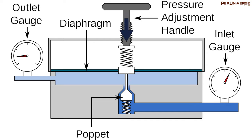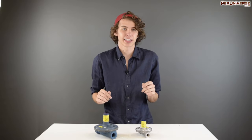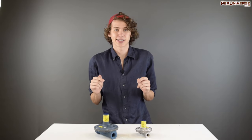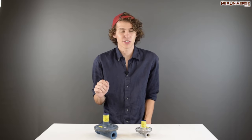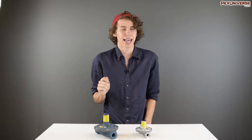As the set screw is screwed in, it increases the resistance of the diaphragm through the spring, increasing the output pressure. As it screws in the other way, it decreases resistance, so less pressure in the low pressure chamber is needed to close the gas exchange. Don't be mistaken though — a gas pressure regulator is not intended to be a gas-tight shutoff. Even if you adjust the screw to its maximum shutoff position, that doesn't guarantee that it won't let any gas through.